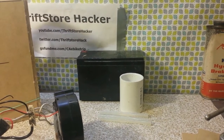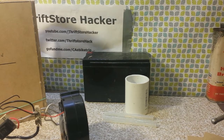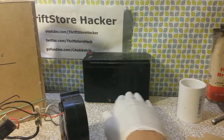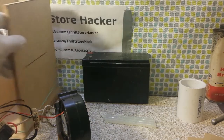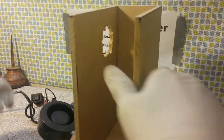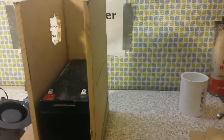We're going to use this brick battery — it's a 12-volt, I think 9 amp-hour brick battery. It should run the unit for about 20 or 30 minutes, enough to dry a set of gloves. If I were to improve this project, I'd probably go with newer technology — this is just a sealed lead-acid battery. You could use a lithium polymer and make it half the size, or even run it off a drill battery.